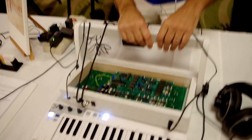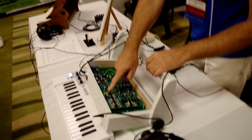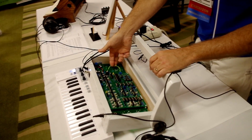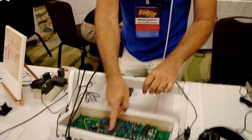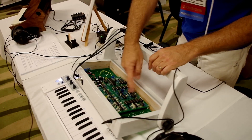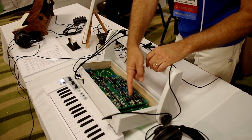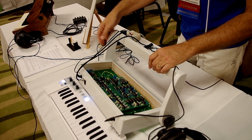Flip this upside down and open it up. You've got a voice card here which is 6x9 — you can see the soft clippers going in and out. The digital section is reading everything over a high-speed CAN bus running 10 times the speed of MIDI. You've got an analog filter, an analog VCA with resonance VCA, two analog oscillators, and then digital dividers to produce the sub-octaves and filters to produce the smooth sub-octaves as well.